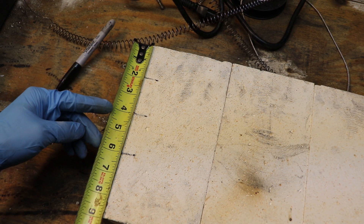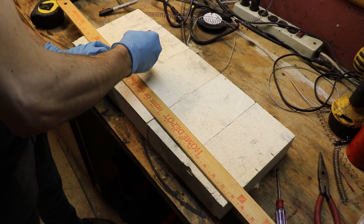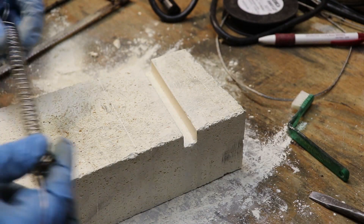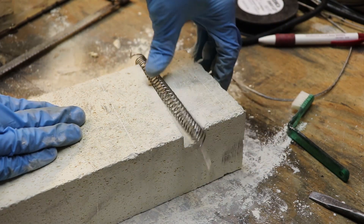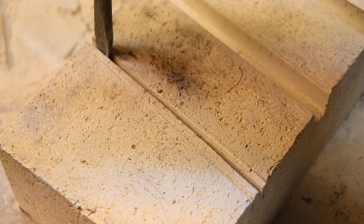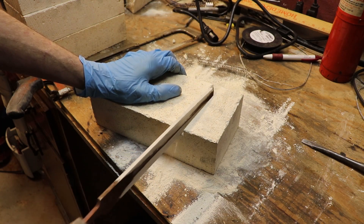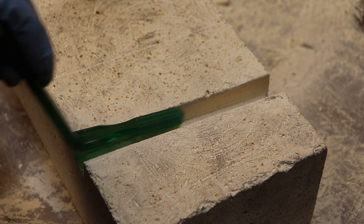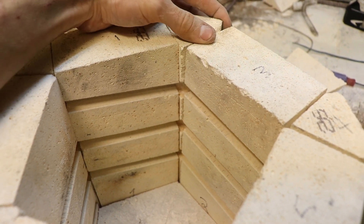Notice how one side starts at 2 inches from the top and the other end of the row starts at 3 inches from the top. I then took a straight edge and made diagonal lines across everything. I was aiming for about half inch deep by half inch wide channels, but this can vary depending on the size of the coil you plan to make. With three slits made by a hacksaw and using a flat head screwdriver, I was able to remove most of the material. Then an old coarse file worked well for removing the rest. A modified toothbrush works well to clean the channel. The corners also needed channels, but the file made quick work of that, and on the inside the channels lined up nicely.